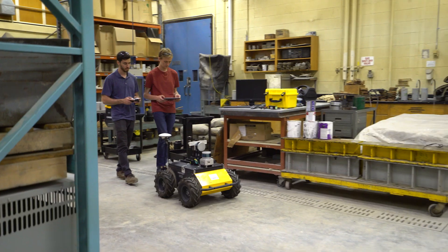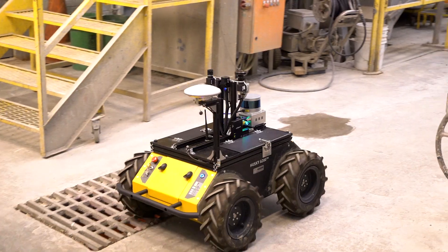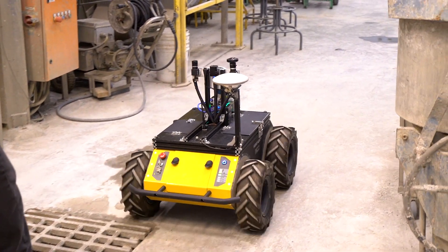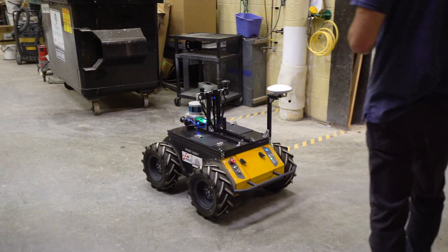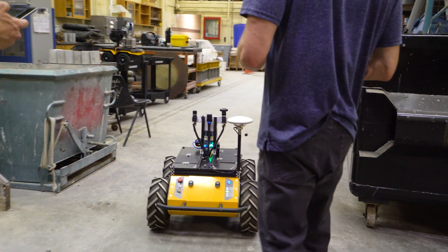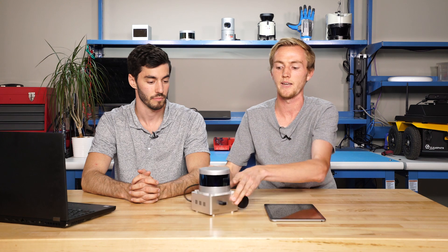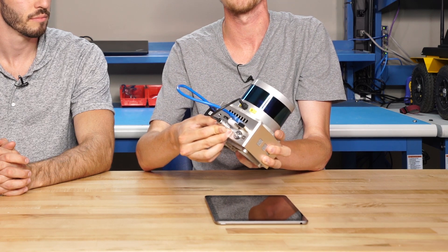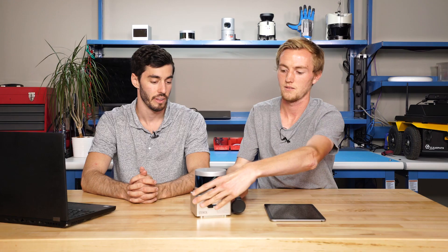In our robots it's really important that all sensors be synchronized — having them all time-stamped on the same frame of reference and triggering sensors correctly. The stencil comes set up with the necessary tools for time synchronization, so we could run our robot with its cameras and other lidars with clocks completely synchronized with the stencil's clock. In addition, the stencil comes with a custom cable for connecting with the Velodyne, so if we really wanted to, we could get full hardware synchronization and use the triggering signals to trigger our sensors as well.